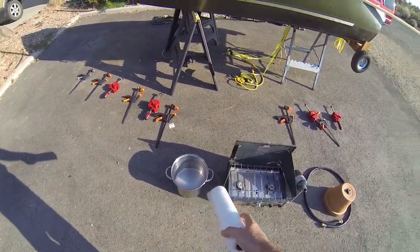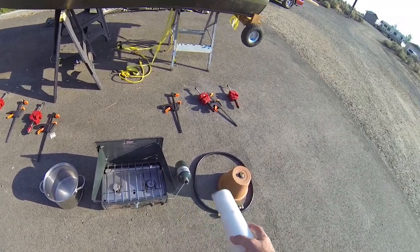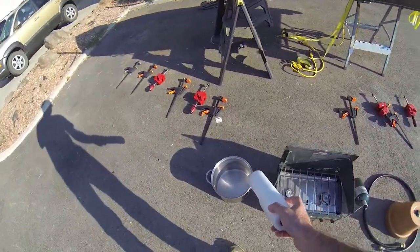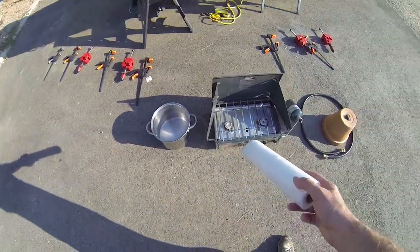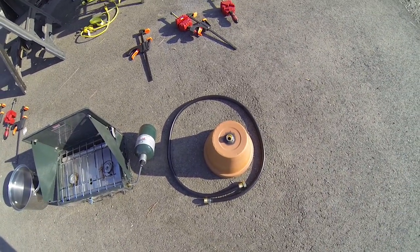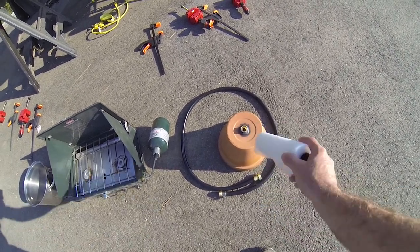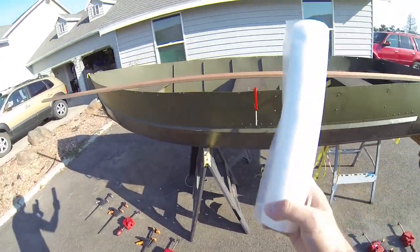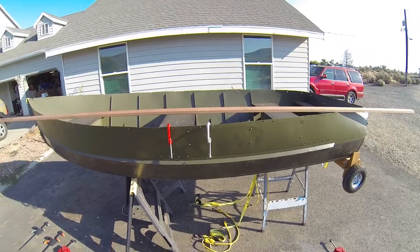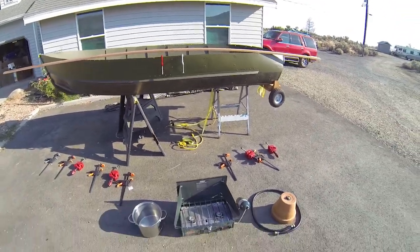We'll get the pot full of water, get it hot on the stove in the house, then keep it boiling on the propane camp stove. A terracotta pot with a hole in the bottom happens to be exactly the size of the lid, so it sits right into the lid lip and captures all the steam coming out of the pot. A standard hose fitting glued into the bottom of the pot with high-temperature silicone means I can screw a piece of hose into the fitting and all the steam will go through the hose into the bag, dissipating along the length of the wood to get it hot and moist. When it's soft enough I'll start running clamps away from center and see what we can make happen — I think it's gonna work.